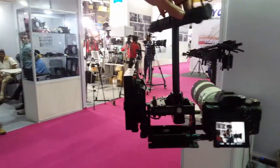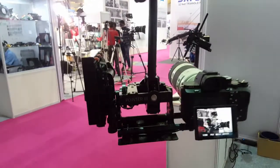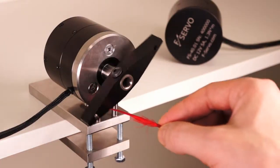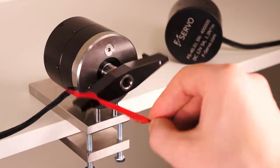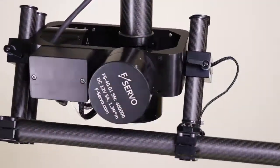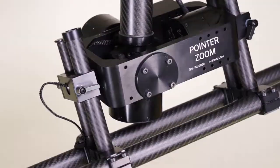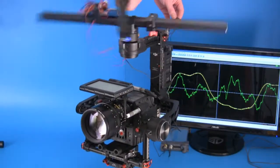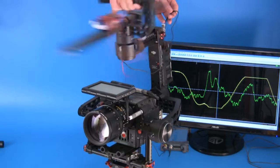The stabilizer equipped with a force servo acts differently. The built-in torque sensor responds to the forces acting from the outside, allowing the mechanism to actively run away from external impacts. Thus, the force servo insulates the camera from vibration. The force servo stabilizer is primarily designed to prevent vibrations from reaching the camera — direction is corrected only afterwards. Therefore, there are several times fewer vibrations registered by the camera when using the force servo.